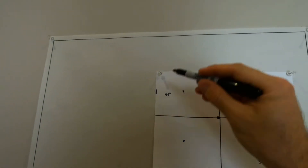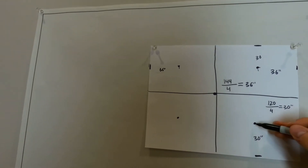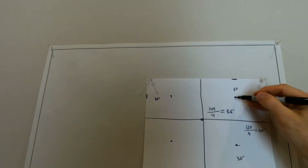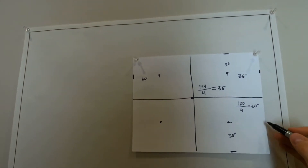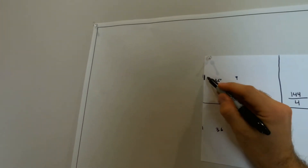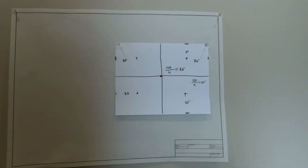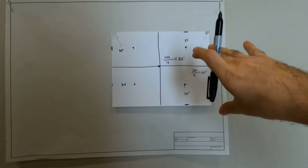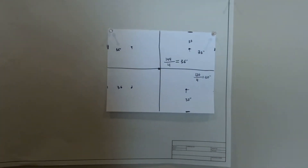So when we do that, we do that same measurement for every can off the wall: from here to here, 30; from here to here, 30; from here to here, 30. And then same this way: from here to here, 36; from here to here, 36; from here to here, 36; from here to here, 36. And there you go. This is how you put a light fixture in the middle of each of these sections. You're basically taking the room, dividing it into four equal sections, and putting a light fixture in the middle of each of those sections. That's how you do it for the best light distribution.